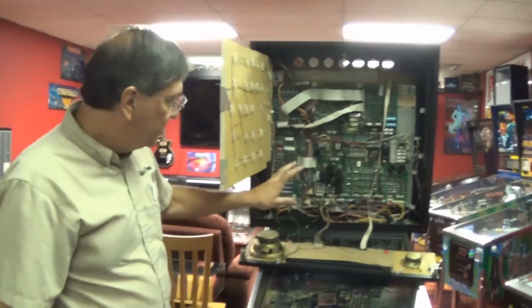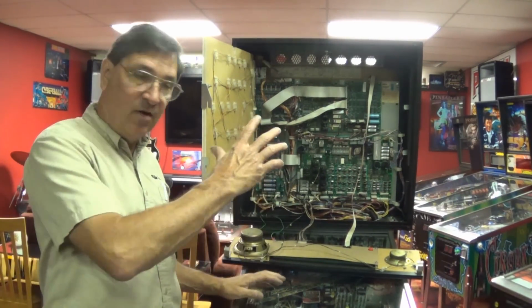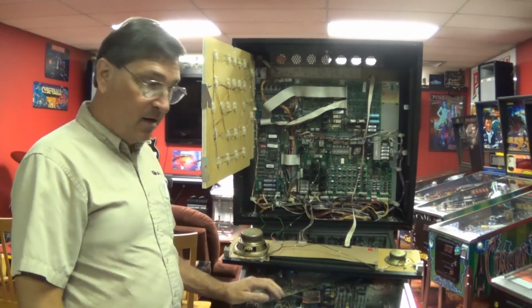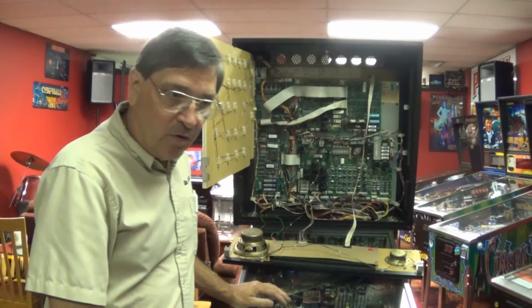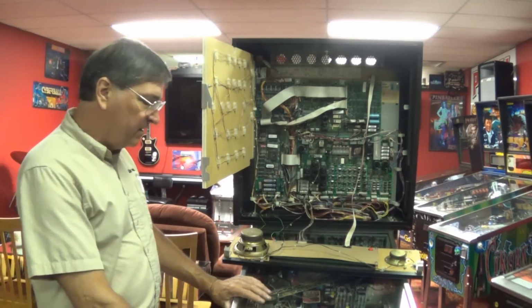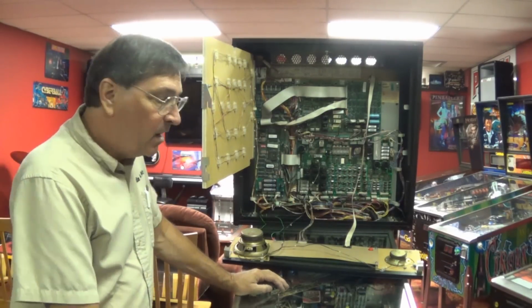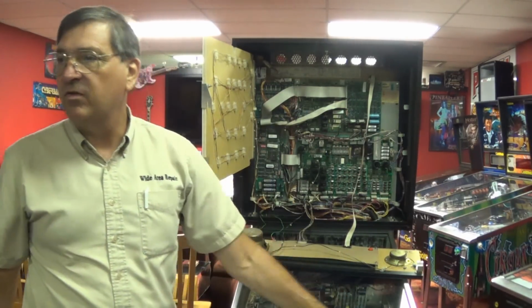This head, when it's on the machine in the hinge position here, is actually over center. The weight is over center. If you don't have a latch on the back, which we'll show you in a minute, if you shake this enough and somebody's got their hands here, it may fall. It will break your hands. It will also dent the stainless steel rails pretty well.